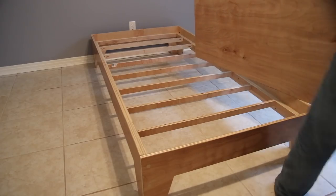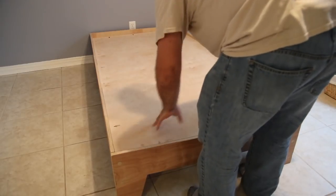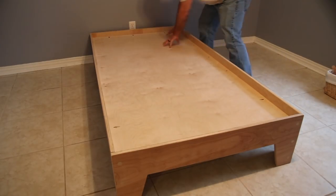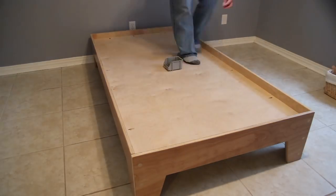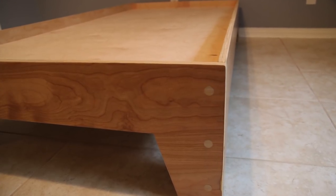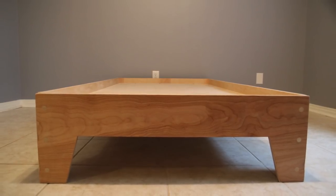The lower support assembly rests right on top of that support ledge on the inside of the bed frame, and with a couple of screws on each side you should be good to go. Then you can add the support panel — it's got pocket holes on the top side. Make sure it's seated nice and tight all the way down to the lower support assembly, then add in the pocket hole screws all the way around. This thing is strong — it supports me walking on it. It turned out absolutely beautiful. If you are not a subscriber, please subscribe, check out the links in the description, and check out the project plan on my website. Thanks for watching!